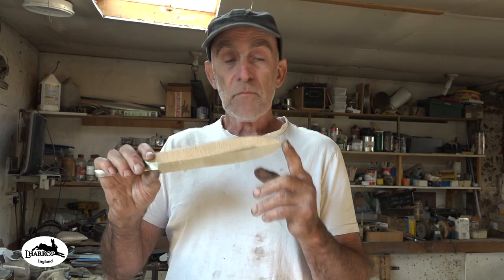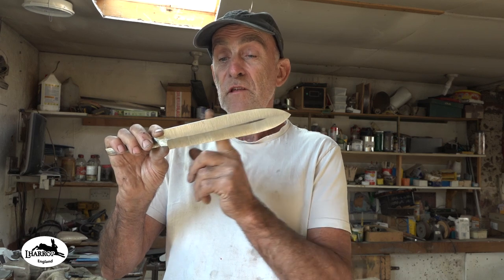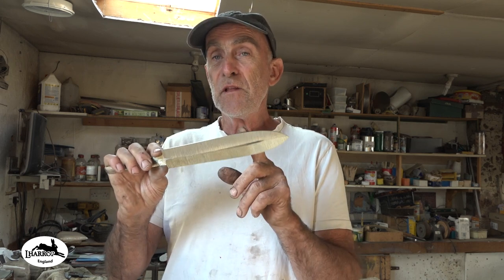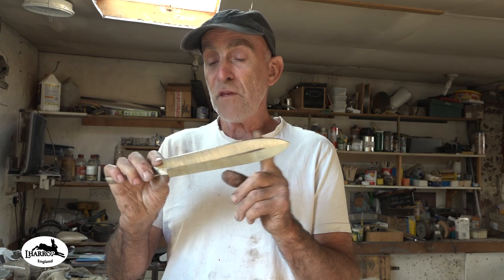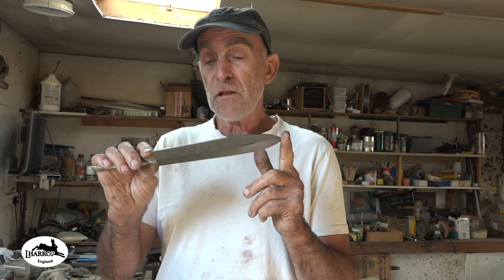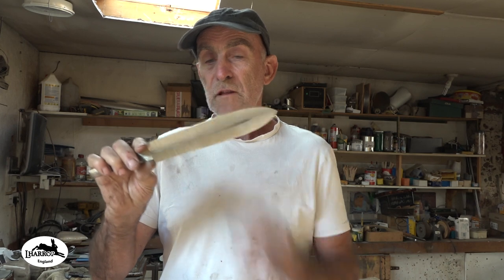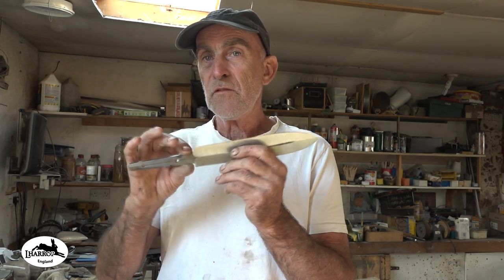And I'm going to show you how I mark out the serrations. Quite a fancy serration on this knife. I'm going to show you how I do it. It's a really wicked serration, and that has to be done prior to heat treat, otherwise you won't be able to do this. It's going to be hand filed, so you don't need any special equipment to do this, and it's like a two-part serration. We'll do the normalizing, we'll do the heat treating, then we'll do the final grind, and the handle is going to be a really simple setup.